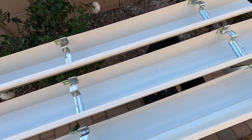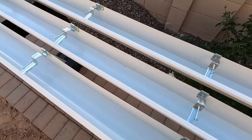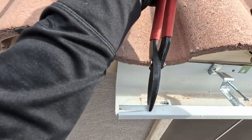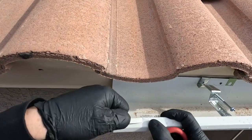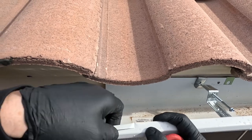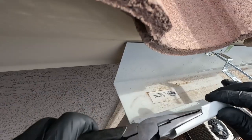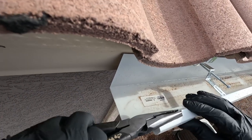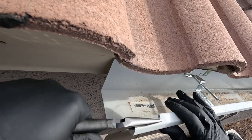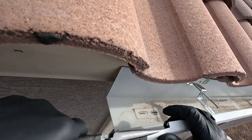You can see how all the hangers are lined up here. I put the gutter wedges just next to the hangers and then I crimped the metal down just to hold those wedges in place. Here I'm cutting the end of the gutter about 2 inches in so I can slide the two pieces together. There's a lot of water in that gutter at the moment — it had been raining a lot so I have to dry all that out before I put the two together so the silicone will adhere to both of them.